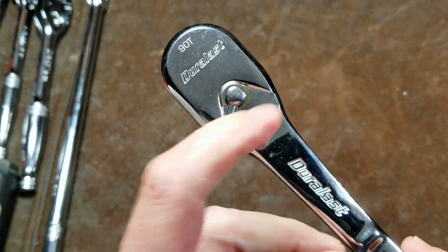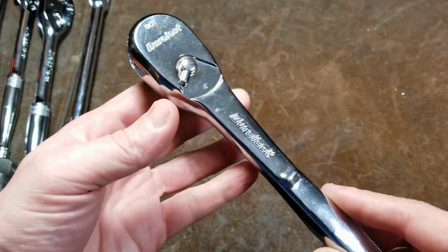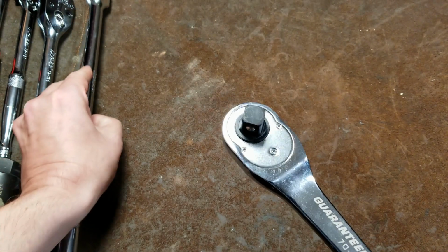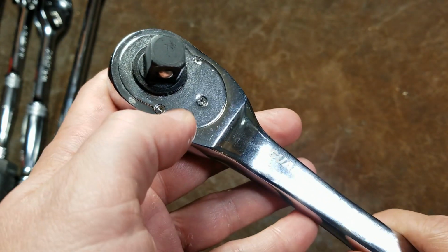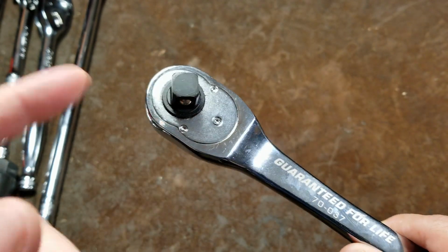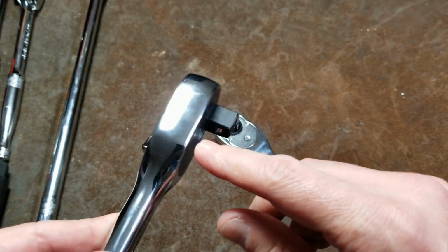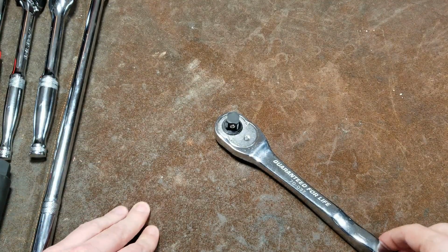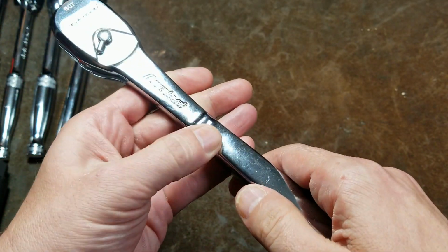This has a finger type pawl design similar to the Harbor Freight Pittsburgh Professionals, and really is just poorly built. It's bottom screwed. I think it's made by the same company that makes the 72 tooth. Bottom screwing is always cheaper for manufacturing, except for its lower quality. If you ever have an issue with the screw holes stripping out, there's nothing you can really do about it. Cross-screwed ones, when you get a rebuild kit, the screws thread into the plate that you're replacing, so it's a design for longevity. This square handle, some people like it, and for me, I don't like this handle at all.